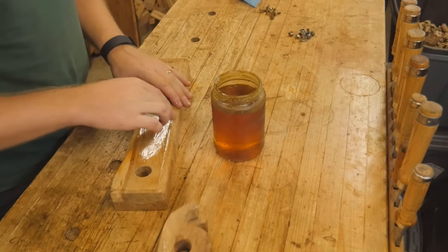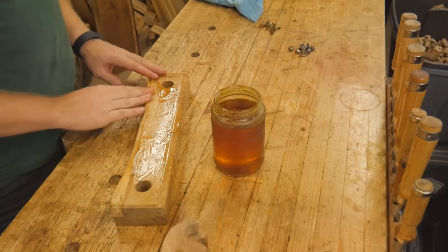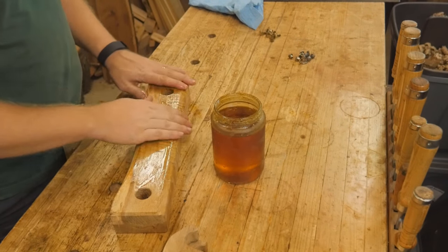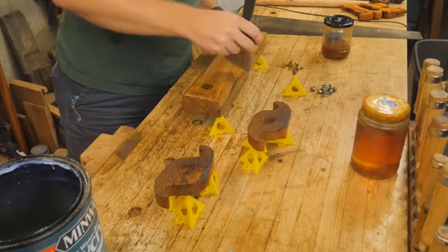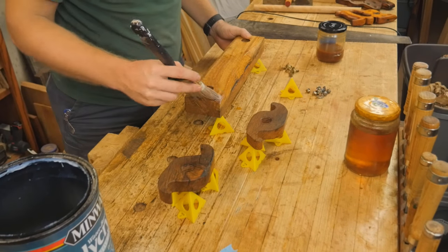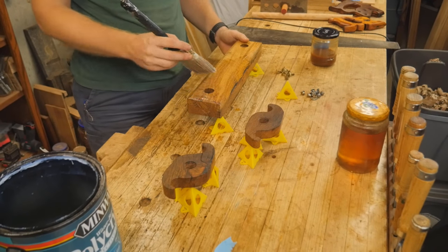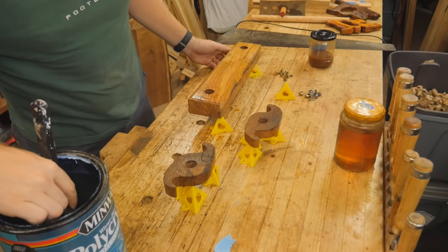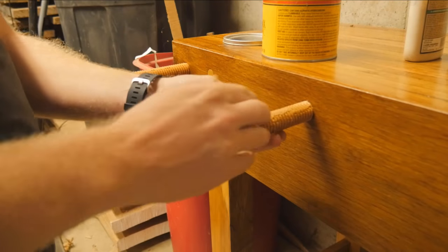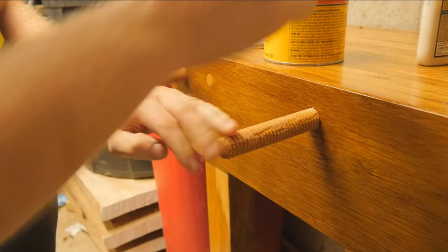For the finish I want to do the exact same as I did on the bench - a few coats of boiled linseed oil letting that soak in completely, and then sealing it with a quick coat of shellac. After the shellac is dried, then five coats of a water-based poly that'll give it a film finish that should protect it for the most part from the kids - but knowing my kids, probably not. A little bit of paste wax on the screws makes them slide a little bit easier and cleaner.